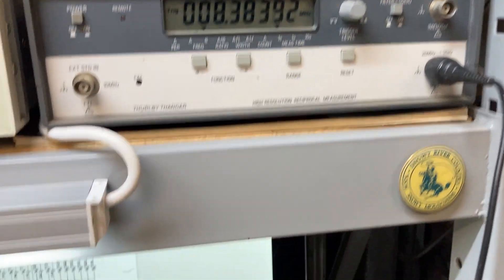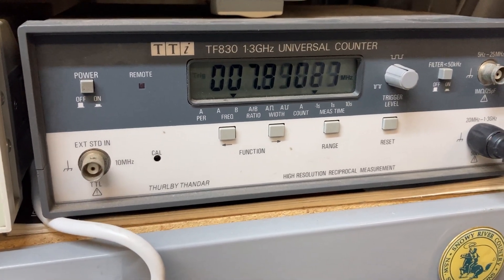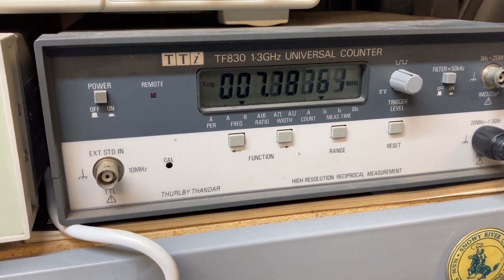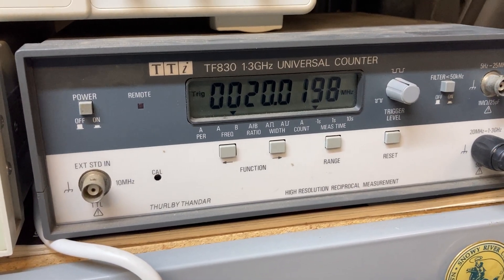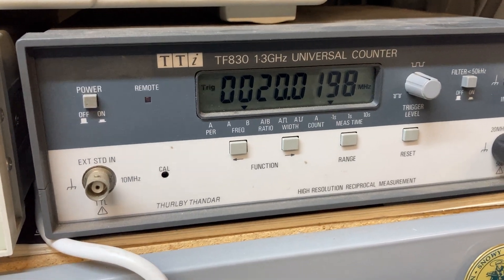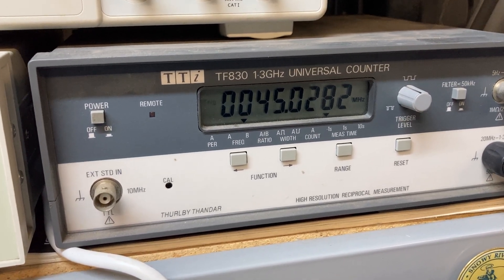That should be stable and static — it should in fact be 9.52. Going to 40 now, and again quite a bit of movement; the 40 meter frequency should be 13.02 and steady. Now coming to 20 meters — the frequency should be 20.02 megahertz, and that's very close to where it needs to be. 15 should be 27.02 and it's stable, but it's at 45 megs, so there's a problem to be sorted out there.